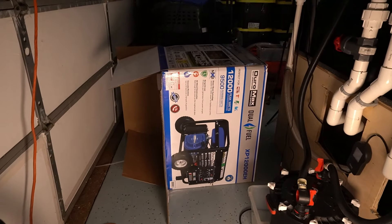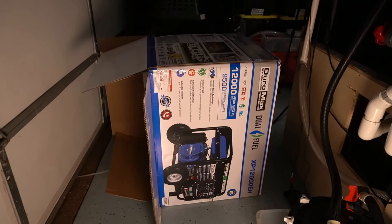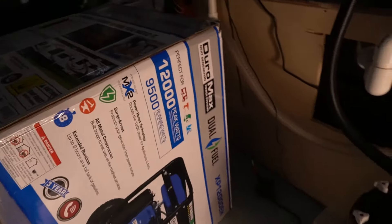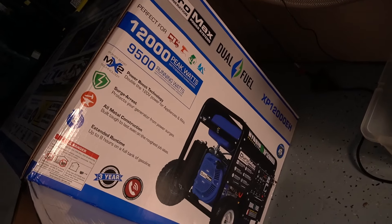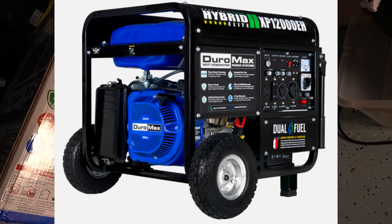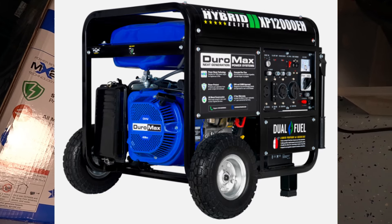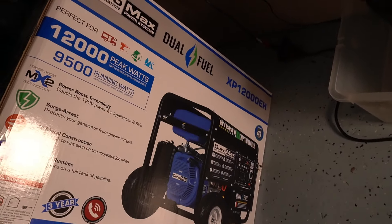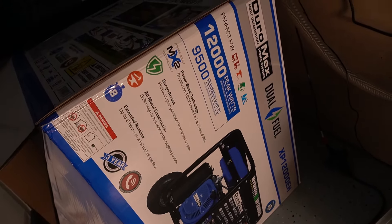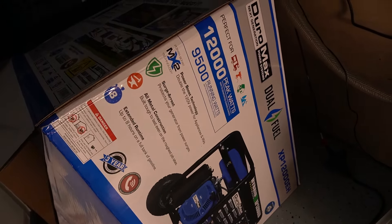Let's get right into it. This is the backup power unit that was delivered yesterday — it's on its side and I'm going to be unpackaging it; it might be a two-person job. It is the DuroMax XP12000EH — they call it a hybrid, I'm not sure what that means. The reason I picked up this unit is because of the high wattage. It will actually crank out 9,500 watts and can be connected to a 50-amp connection, so I'm going to put a 50-amp transfer switch right on the side of the house.